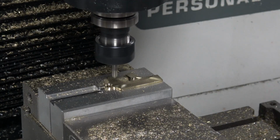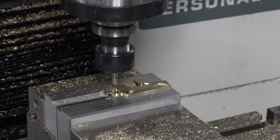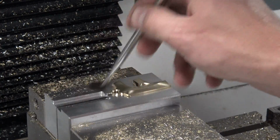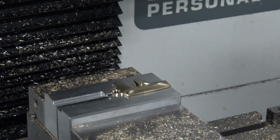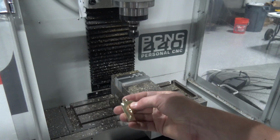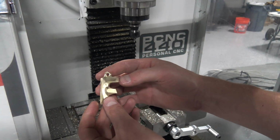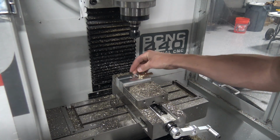And now chamfer the outside of it, which this should look okay. Yeah, that's better. Using a 2D chamfer to avoid touching the solid model where it's not supposed to be chamfered, which is an awesome Fusion feature again. So no coolant and soft jaw to finish the part. The GoPro, it's looking like this is, I don't know, 45 minutes or so. I think that's awesome. I love it. Logos on the back. Part's right there. Awesome. Just, we live in a great world, folks.